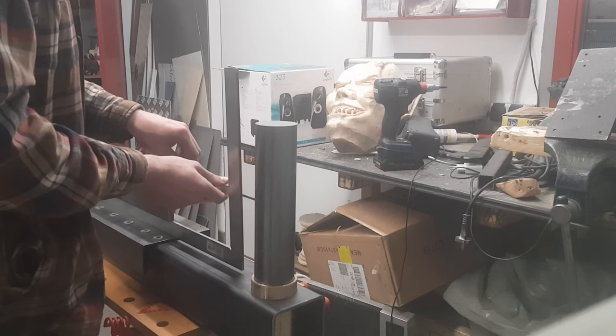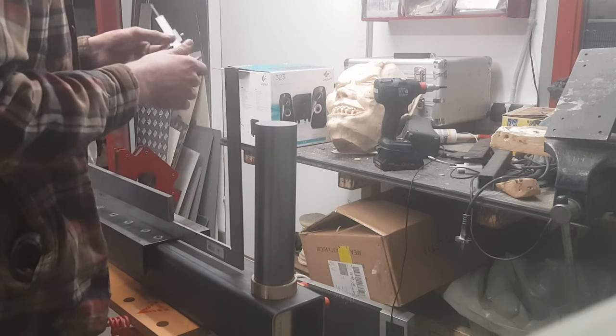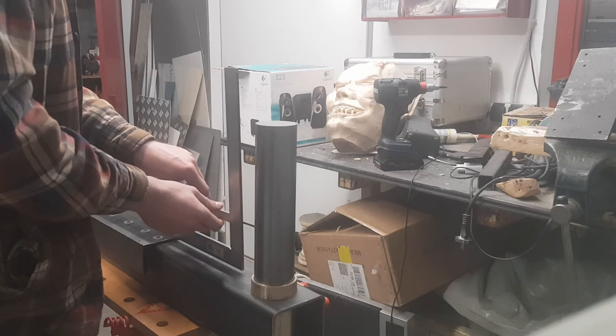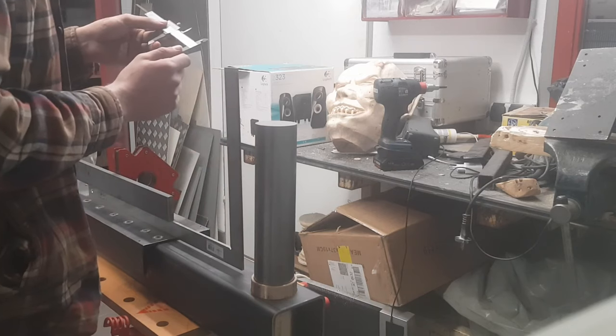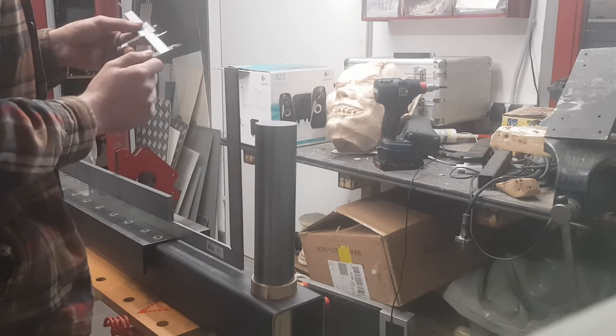The difference between the highest and the lowest point I measured was about 0.3 millimeters. The axis of the spindle is approximately at the height of measurement 2, meaning I got an error of about 0.15 millimeters. I got that number down to just under 0.1 millimeters by putting some shims under the U-section.